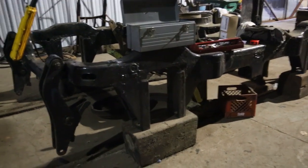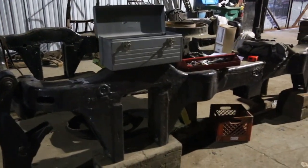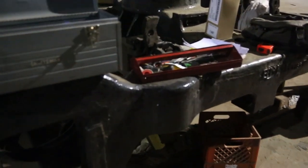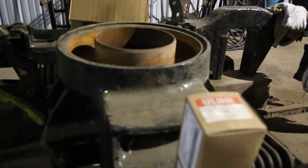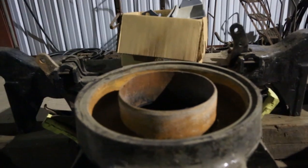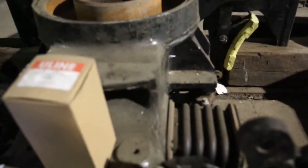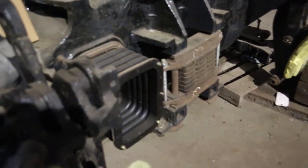And this is the truck frame assembly. It's one big casting, complete with my toolbox and a bunch of other junk sitting on top of it. But this will just slide down on top of the equalizer and journal boxes. Interesting thing about the way these work, this is what's called the center plate or center casting. And on these particular trucks, the cooling air for the traction motors goes through that center hole through the truck casting and then out these ducts into the traction motor.